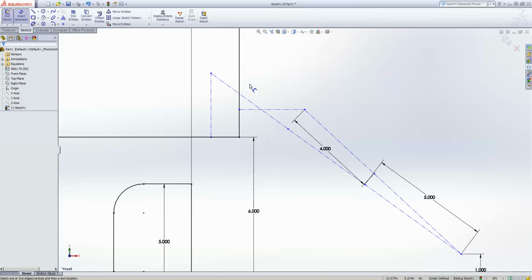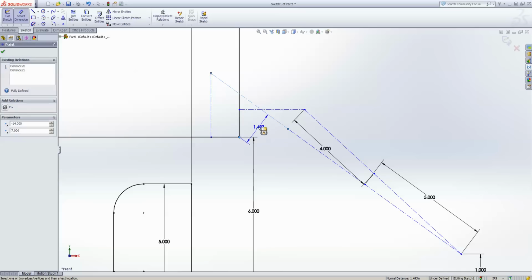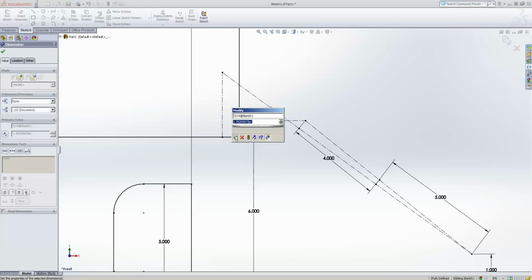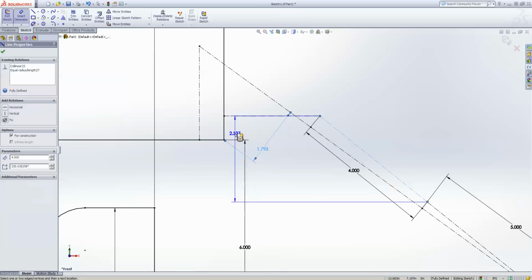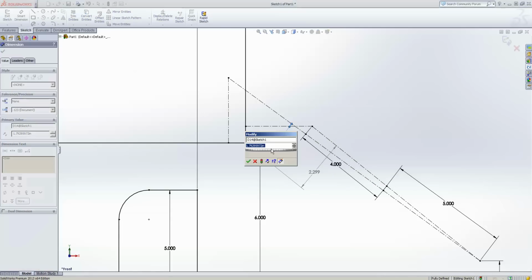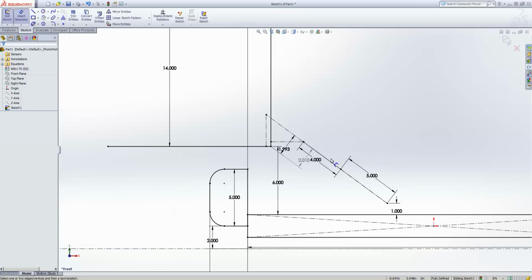One dimension I like to play with is the lever arm you're acting on. That's the perpendicular distance from your pivot point to there. And maybe that's something you want to maximize. What you can do is make the lever arm for one a driving dimension and make the lever arm for the other a driven dimension, and maybe compromise on those. So go, oh, I want this to be a little bigger to drive those more evenly. Wow, that looks pretty even.